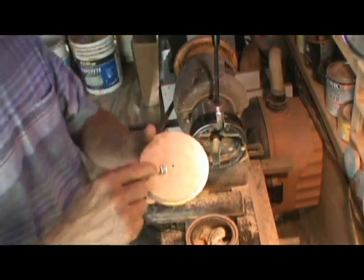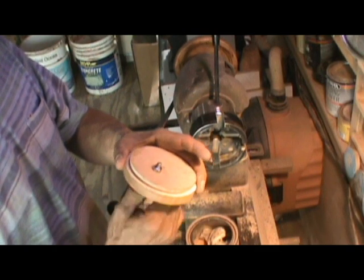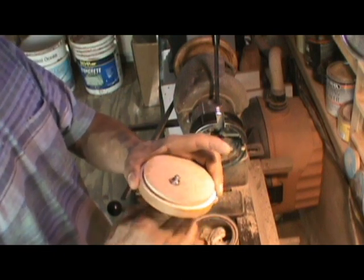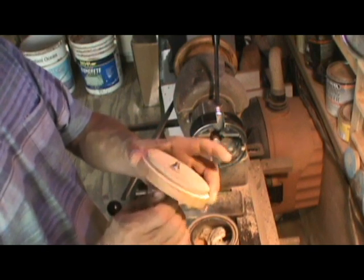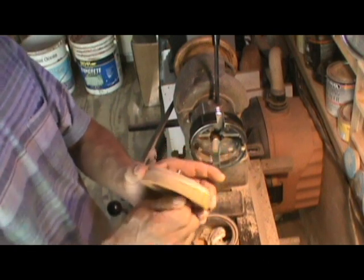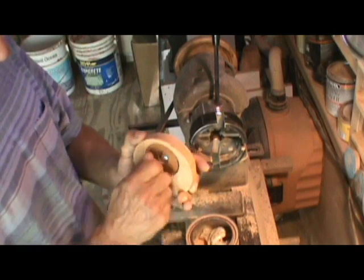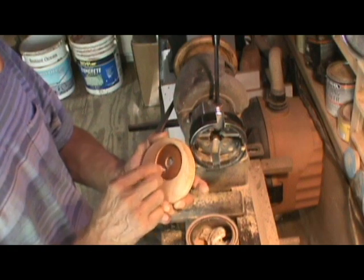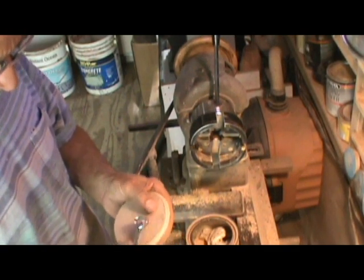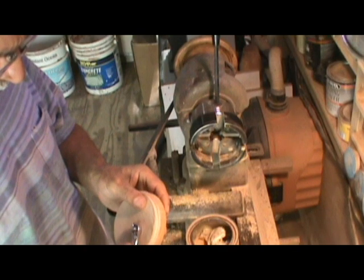Now I'm locking up the nut on the back side also with a little bit of CA in there, because I don't want to keep tightening it up or loosening up. I want it to move with the piece as I spin it without it becoming sloppy. So I could have put a washer in there, but I didn't have one that really fit on that. So I got an easy motion on this, and that feels pretty good. If I can give it a slight snug, I want it to move, but I don't want it to be really loose.